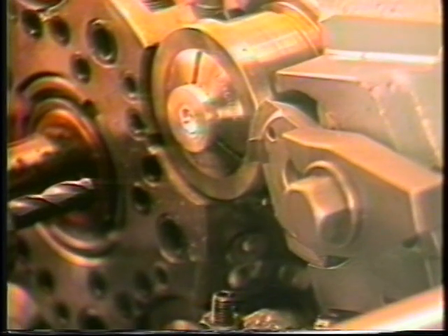Some tool centering gauges may not have been machined for the third position. Once the tool has been set to center, it is strongly advised to verify the tool position by facing a bar with the form tool.